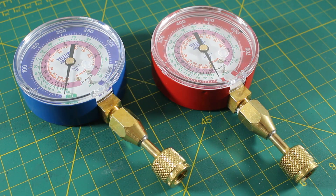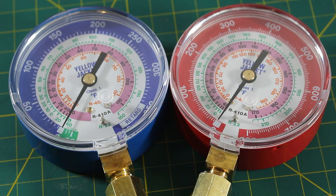These gauges are the best you can use, in my opinion, for testing purposes only, as you have the smallest loss of refrigerant while detaching your gauges. There are many systems that hold a critical charge, and these are perfect for when a test is needed.